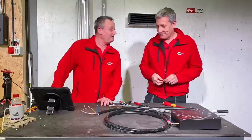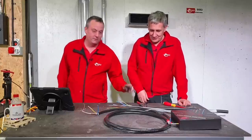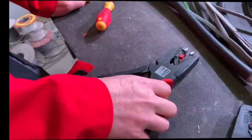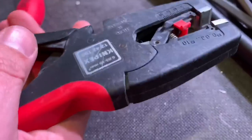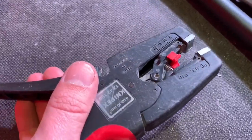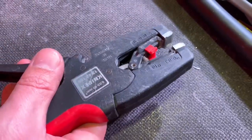Looking at the desk here, I've got a funny suspicion you might have owned one of these before — this looks like a legacy tool. We've got the newer version here. I have a confession to make — this is the Multi-Strip 10, its predecessor. I actually bought it because I needed to strip some PTFE cable. PTFE is a tape, but you can get it in cable form for special purposes — it's very difficult to strip, and this was the only stripper I could find that would actually grip it and strip it.